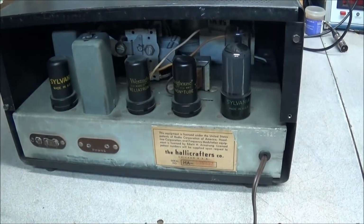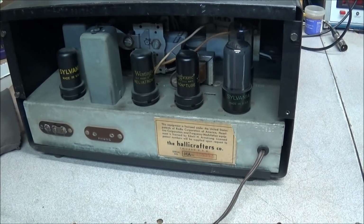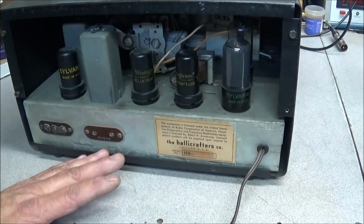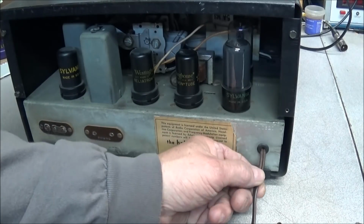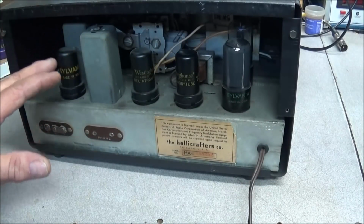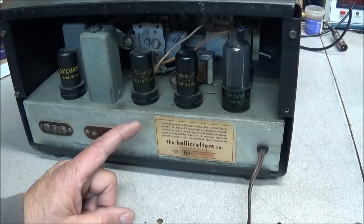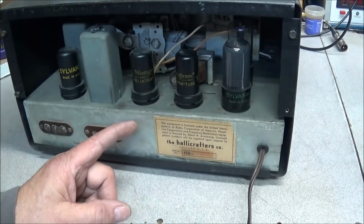Alright, back to the power cord. The old power cords that came in these radios were non-polarized, which means you can plug it in either way. Okay, no problem, right? Wrong. The problem is that one wire goes straight through the circuit, and the hot side goes all the way through the whole circuit, right on up to the last filament of the tube. The other wire goes in, goes to the switch, that's the off on switch that's mounted on the volume control, and straight to ground.